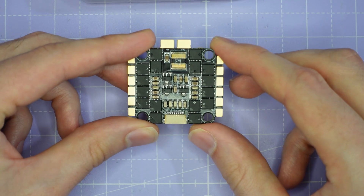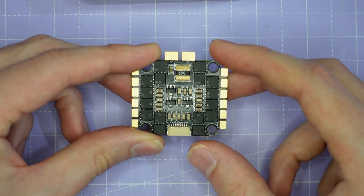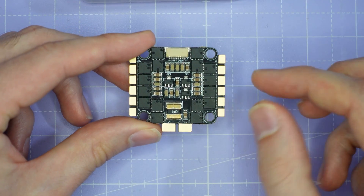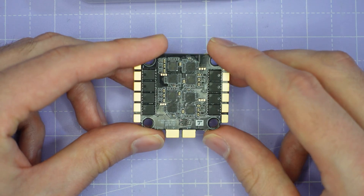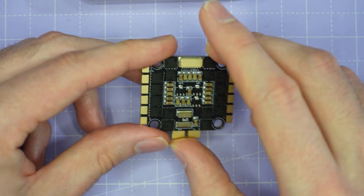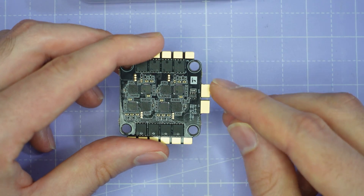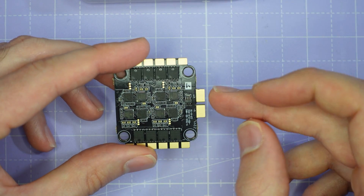That's going to be a pretty similar plug layout to a number of other ESCs, but particularly older ESCs sometimes have different pinouts so you're going to want to check. This is kind of the new Betaflight standard pinout. In terms of motor outputs, we've got four and they're all pretty big pads, so it's going to be pretty easy to solder motor wires onto these — not like some smaller ESCs where the pads are small. If I flip the ESC over you can see we've got the same size pad on top and bottom, making it really easy to get those wires connected. We also have big pads for battery voltage, the negative and positive terminal. The ESC doesn't have any pin location for the capacitor, so you're going to want to solder it onto these pads. I'd suggest soldering the capacitor onto the opposite side from the wires, and probably after you've done the discharge lead, since the capacitor legs are going to be smaller.